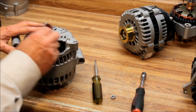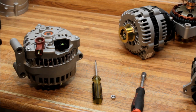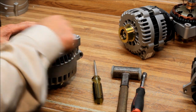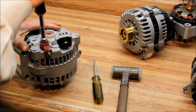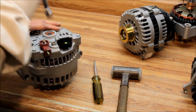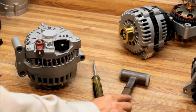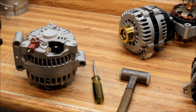The next step is to put the battery post extender back in. The housing may be slightly off, so give it a little tap to straighten it out so the battery post extender goes down in there properly. Once everything is on, snap the little cap back on, and that is it — you have successfully changed the voltage regulator on a Ford 6G series alternator.